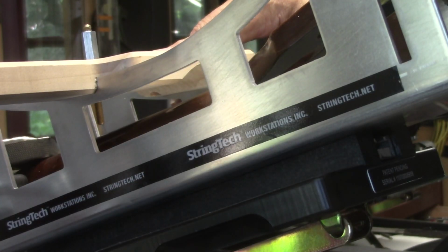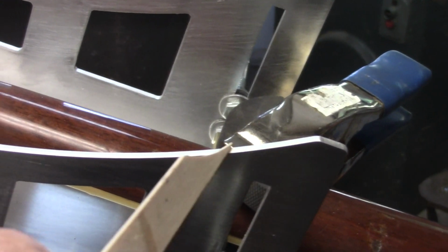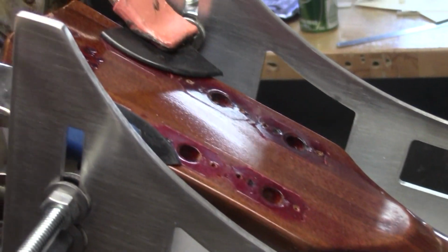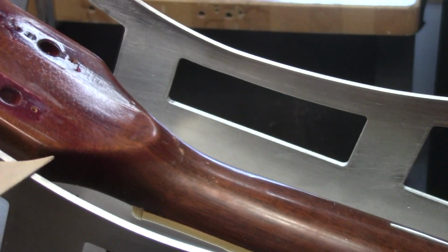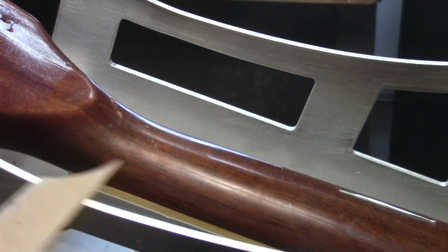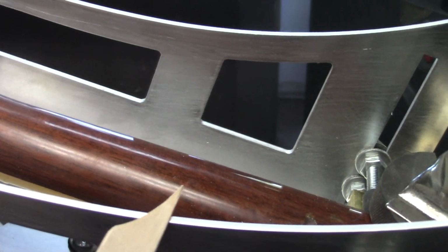No guesswork here. Like I said, long before you flick the switch on the router, you know exactly where you're making that cut. So the two sides of the neck surgery jig are elliptical. This end allows you to make a shallow cut, and this end is a deeper sweep, and that's the one you're going to use most of the time on Les Pauls. So we're going to go into the worst part of that break. That'll be the deepest part of the cut, and then in this case it's going to exit somewhere around here,